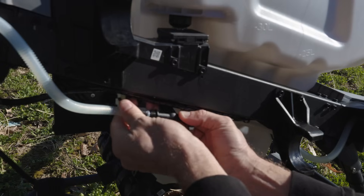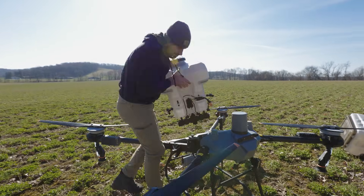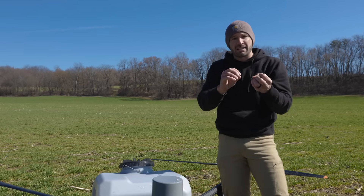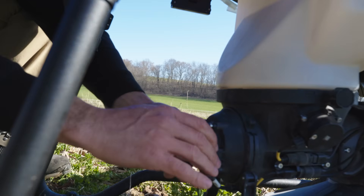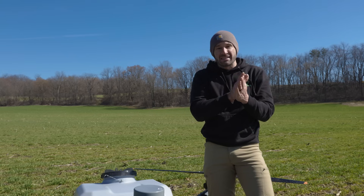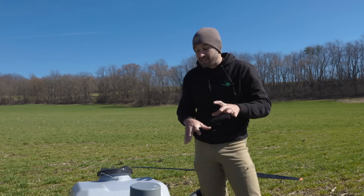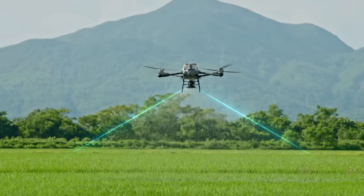It's really easy to swap tanks. You take these hoses off on both sides, pop off your electrical system, pull out the liquid tank, and drop in your dry tank. Plug it in. For accuracy, you can change your auger size — say you're doing a smaller, finer seed, you pop off the auger in the back, open two latches, pull it out, and slide in your other auger. It has three different auger sizes: large, medium, and small for different seed sizes. I'm really excited about the spreader, and the accuracy on unloading your load is much better because of the auger system.